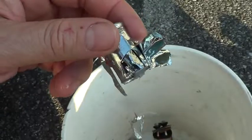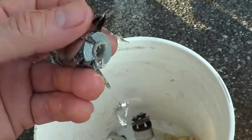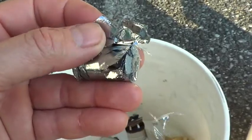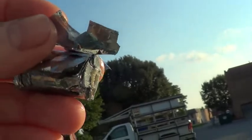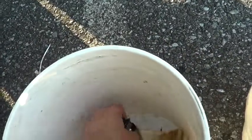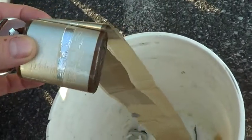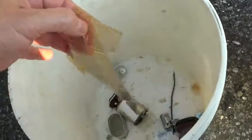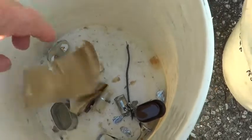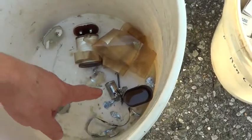As I suspected, the aluminum is much thinner on the new capacitor and the insulator is just part of the aluminum — it's like a coating. You can actually see through the aluminum it's so thin. On the older capacitor it's thicker aluminum and almost looks like a paper insulator. The new insulator is thinner than paper. They had a better insulator on the old capacitors, hence the bigger size.